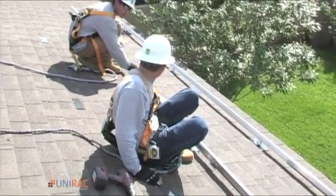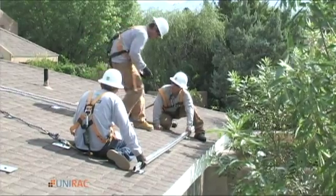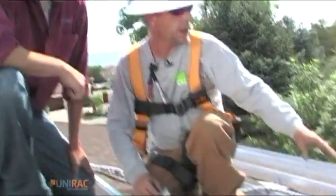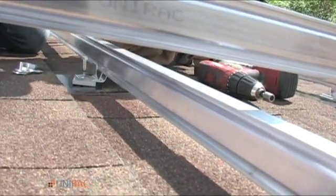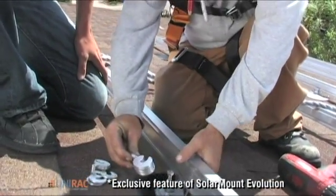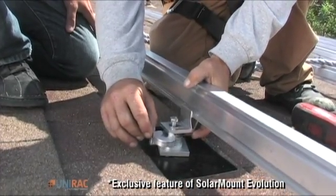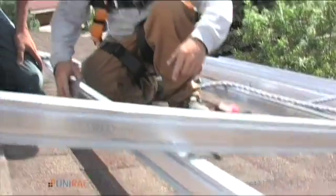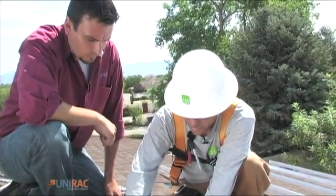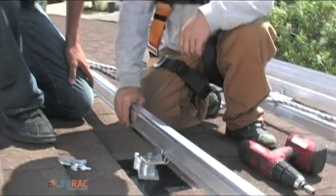No roof is perfectly flat and PV installers have to contend with what is known as roof undulations or peaks and valleys across the roof. What we've done here is we've got our other rails already tightened down and we've got our straight edge coming across here, and as you can see with the dip in this roof we have to raise this one up. So we take these shims, which are really convenient because they just slide underneath and bring us up whatever we need, and then we can break off what we don't need. It looks like we're going to need about nine shims underneath, and you can see it raises us up so our array turns out planar. We'll snap these off and run the lag down and make everything tight.